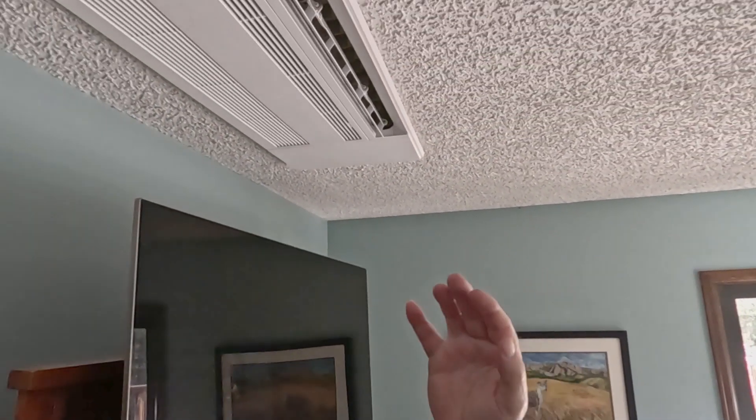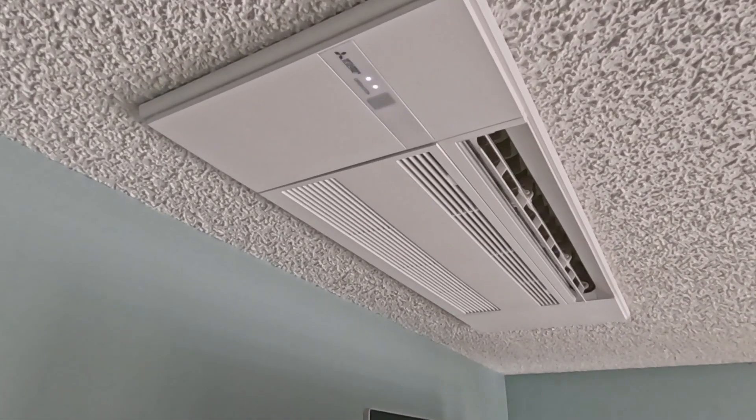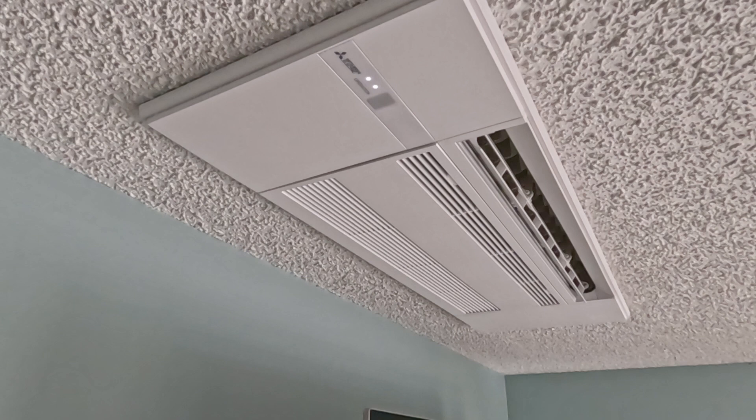If you look up here and see these two lights — what those two lights represent is if the thermostat is giving it a call and it's beyond four degrees, it's going to have two lights on. If it's within two degrees or satisfied, it's going to drop to one light. The MHK2 is actually going to give you a digital readout of the room temperature and your set point, so you really know how warm it is in your room. What's great about these machines is you have room-to-room thermostats and true BTU unloading — you don't have all that static pressure loss of traveling through ductwork.